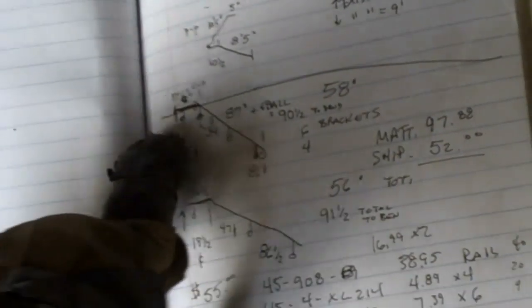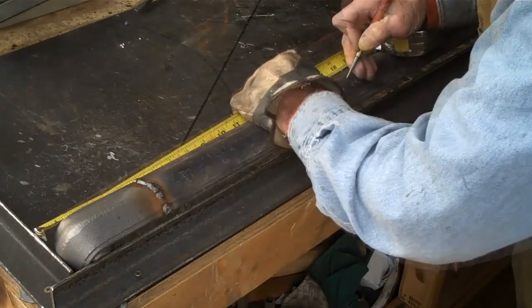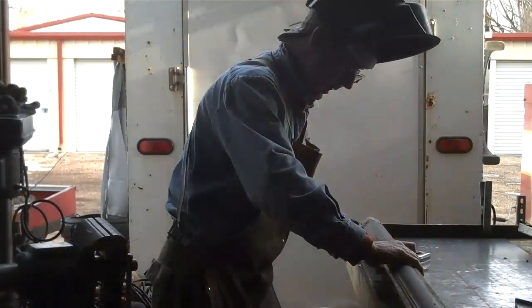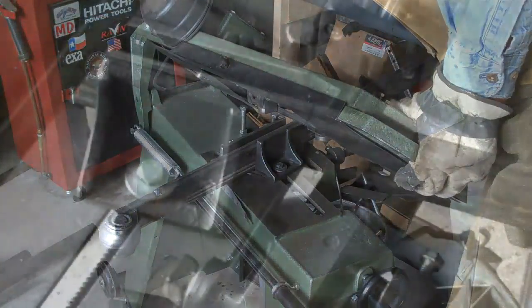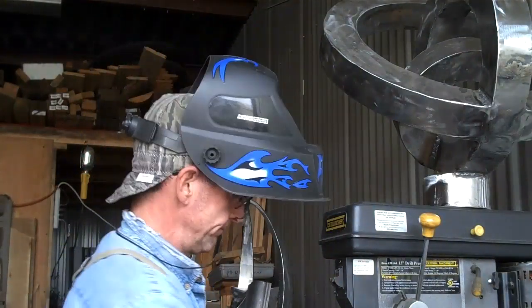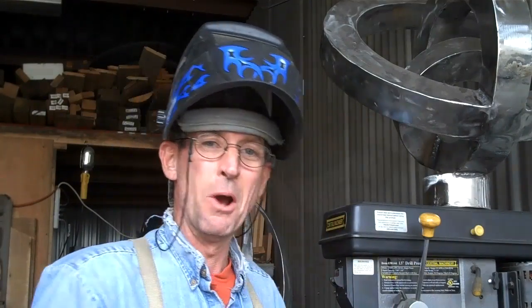We want to cut our first one at 17 and a half — from the outside of the volute to the long point on the flat: 17 and a half. I'm going to use this angle iron again, butt that in, pull our 17 and a half here, and mark it to the long point right there. Then it's just a matter of taking this over to the bandsaw, setting it on there, and cut. It's as easy as that. Just do the same thing to the other ones and start welding them up.